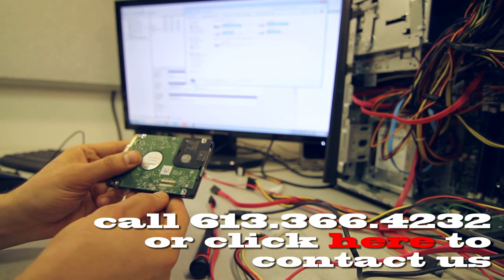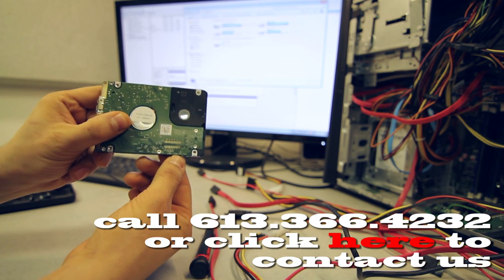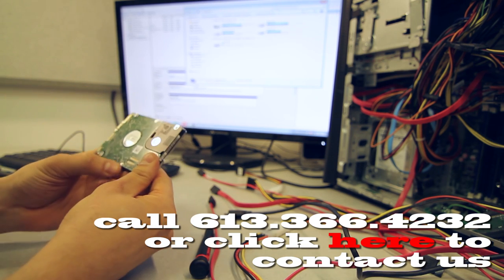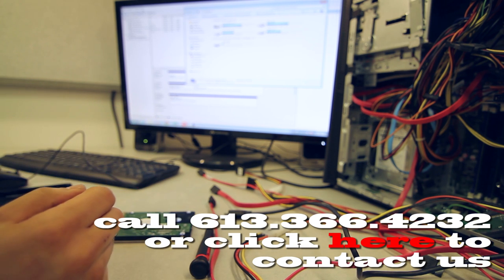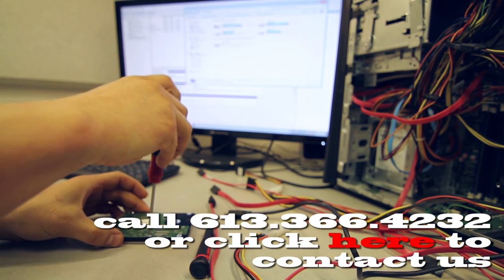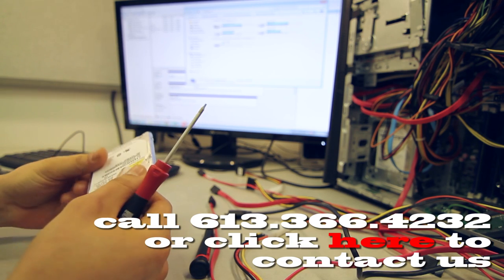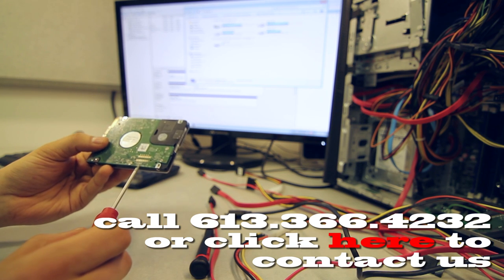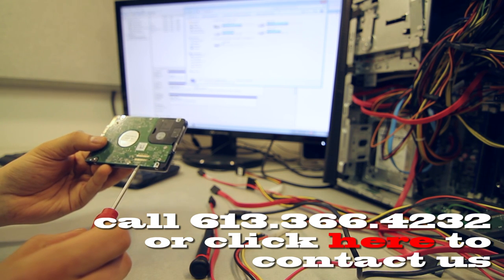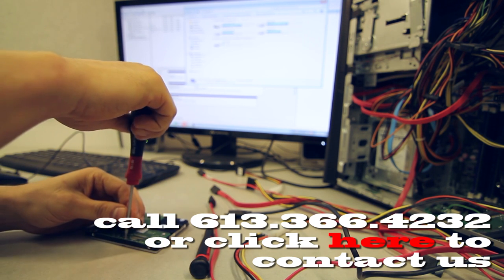What we have to do is look at that number right there. I don't know if you guys can see it, but I'll post it in the description. This is a 771961 board. What that tells me is that this board is actually compatible with a SATA counterpart, which comes in the regular 2.5-inch drives that Western Digital is selling. The board would end with 771960, and those two are compatible.